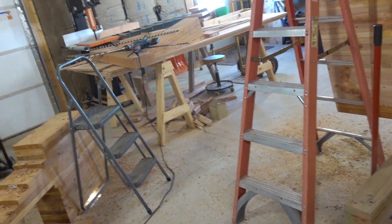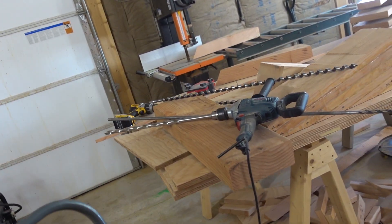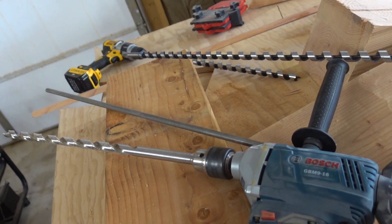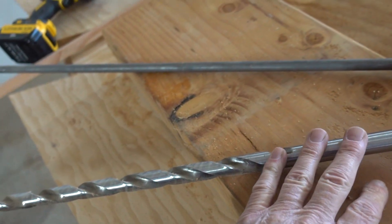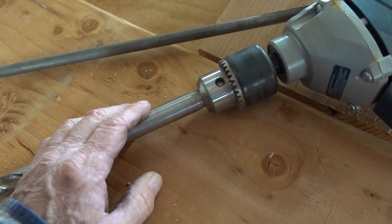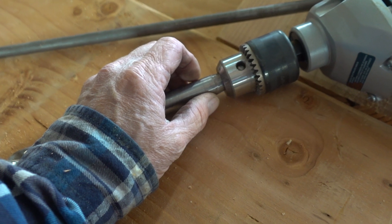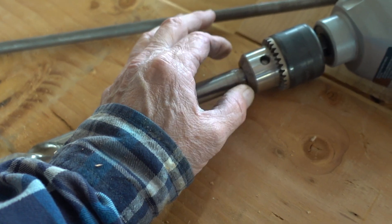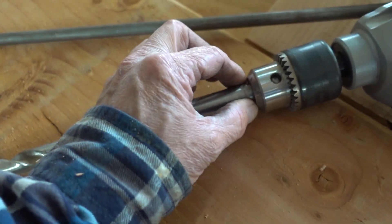Still the same day, March 18th. I decided that the best method might be the easiest method for this three-quarter inch drill. My Bosch here has a five-eighths inch chuck, so I decided to quit overthinking things and tackle the problem more simply. I only needed to take a sixteenth of an inch off, so I just put this in my bench grinder and ground it down.